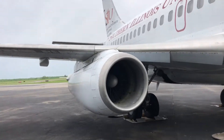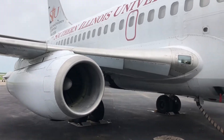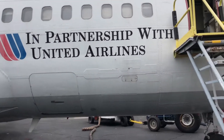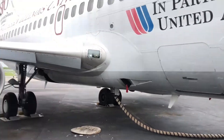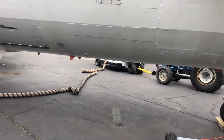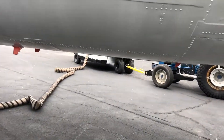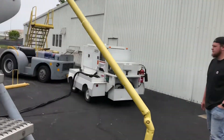The objective for today is to dry motor the JT8D engine on this 737-200. To do so we need both pneumatic power — since we're not using the APU — so we have our ground huffer unit, our portable huffer right there, and we have ground power here as well.